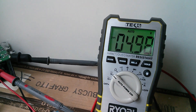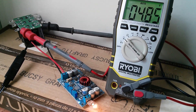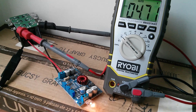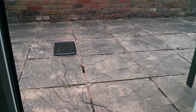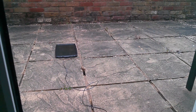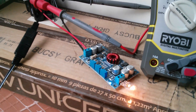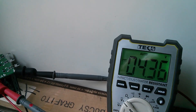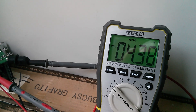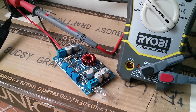Now of course when the light comes on, that voltage plummets on the supercapacitor bank, and that light won't stay on long as that voltage falls down. That light will go off. It's just occurred to me that that light is a constant wattage — I think it's one watt. And if I let the supercapacitor bank get up to the max power point of the solar panel, which is the high end of the voltage, that solar panel should develop under full sun in excess of two watts. So it should be able to keep that light on permanently. Of course, that's now going to start creeping back up. So really what I want to do is get this supercapacitor bank up to a higher voltage so the solar panel can sustain having that lamp on all the time.